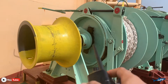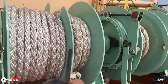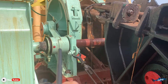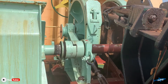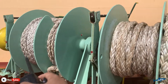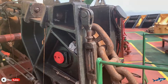Normally there is one shaft which is connected to all the winches plus the windlass. You can see here — this is also rotating, and the same shaft is passing over here, and the same shaft you can see over here as well. We just put this gear — whichever winch we want to use, we put it in gear, otherwise it will just rotate the drum. Only once you put it in gear — let's say I put this one in gear, this winch starts working; if I put this one in gear, this will start working. For now we have this windlass in gear, so the windlass is working right now.